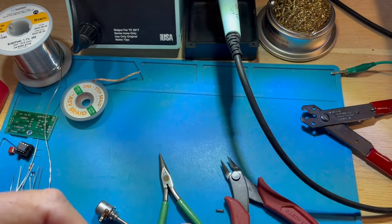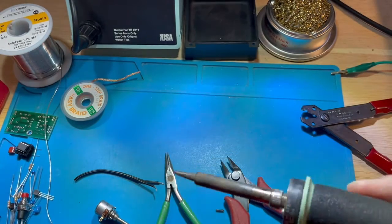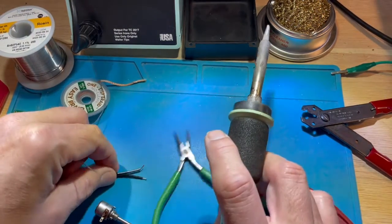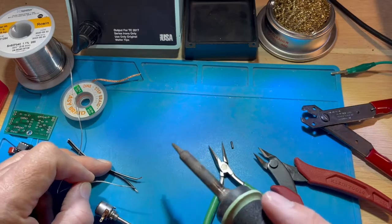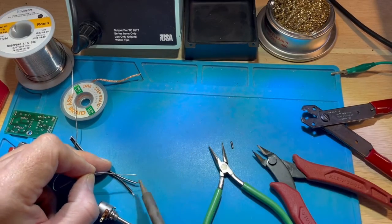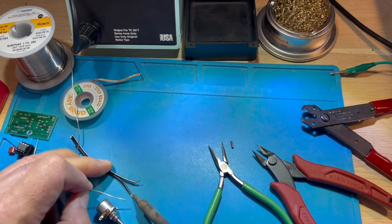After I twist the stranded pair together, we're going to take the soldering iron, which is hot. It's on. We're at 700 degrees Fahrenheit, and we're lightly going to tin the wires. Now this can be done in a fancy holding vise, but over the years, with some experience, you'll see that you can just hold it separate right there. We'll lightly tin both sides.